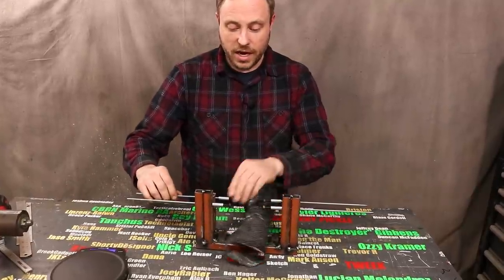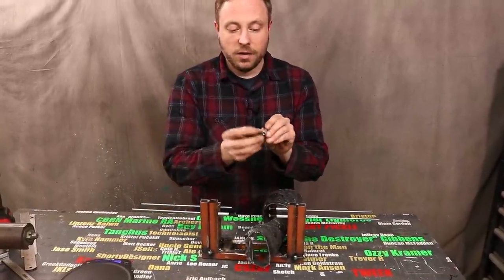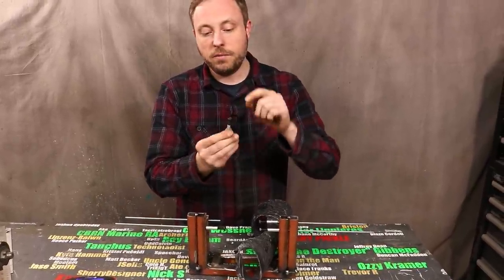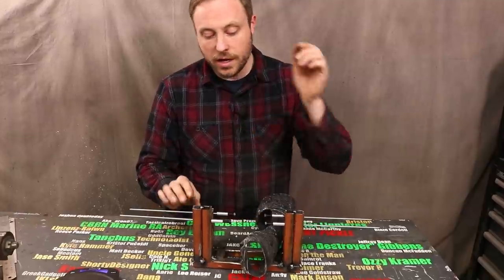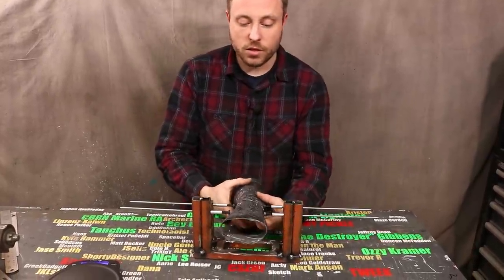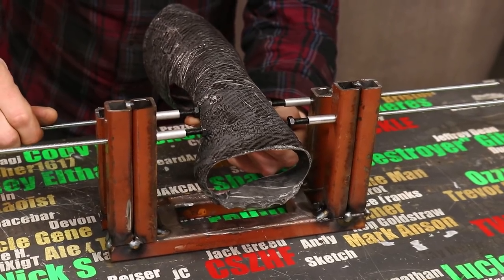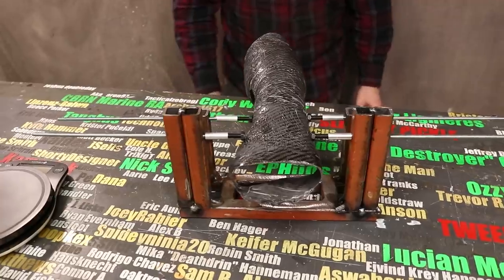So I have these little 10-32 rods with aluminum spacers that fit them very accurately. And then I threaded them for M6 bolts. They slide on and it makes all this stuff stay square and in relation to each other in wide open space. Now I'm just gonna make the decision on where they're going to be mounted. Something like that.